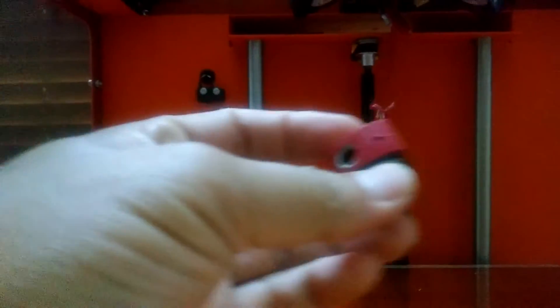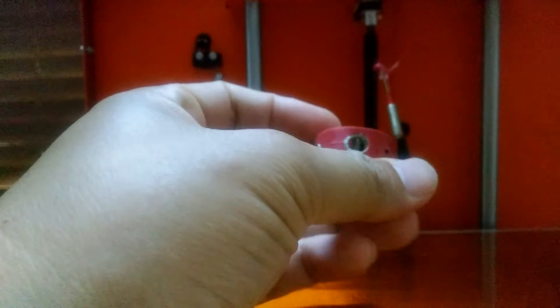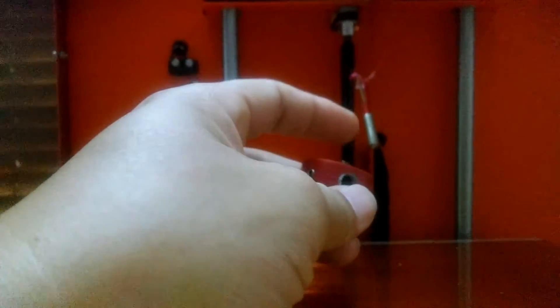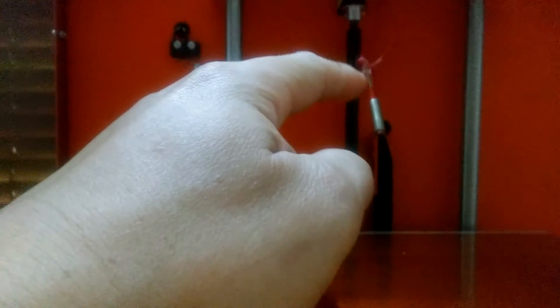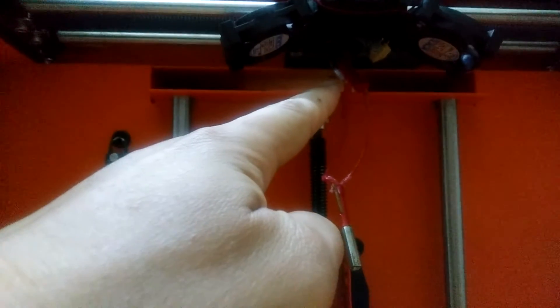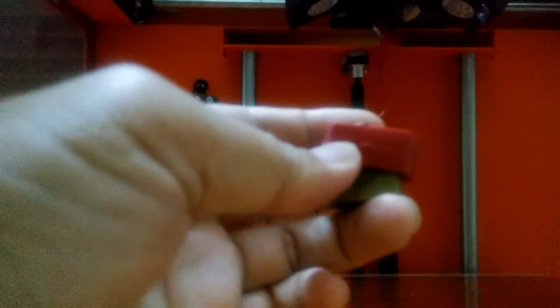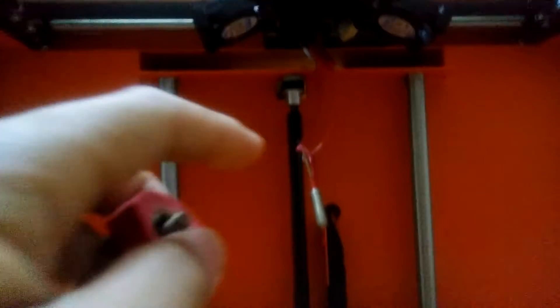There are two wires. This wire that goes into the heater block sets the print head temperature. Before you can remove this wire from the heater block, you've got to loosen the allen screw here — you can't just pull it up, or you run the risk of damaging or even pulling up the wires from the heater cartridge. This little thermistor here also goes into the heater block; it senses the temperature set for the print head and also the printer bed.